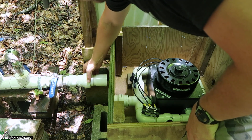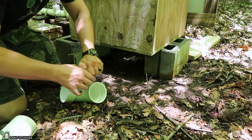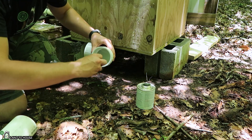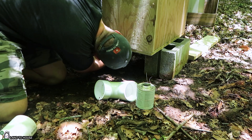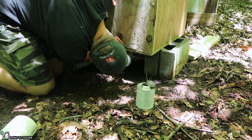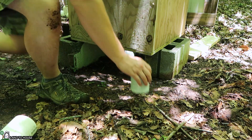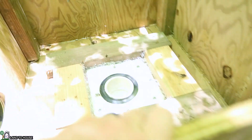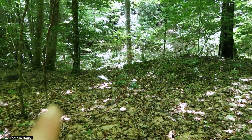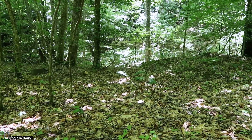This isn't the official install video, but I'm going to get this plopped right here where it's going to be. I've got a union so I can put this through here and install it. That hole is plenty big enough to get that installed right where it needs to be. Now I have to go up under here and install this 90-degree fitting for the drainage. I'm getting PVC cement on the pipe and on the 90, putting it under here at an angle off towards the creek. There's the 90 coming out from the bottom, coming down from the uniseal. This piece will then have about a 20-foot piece of pipe going to that tree and down to the creek.